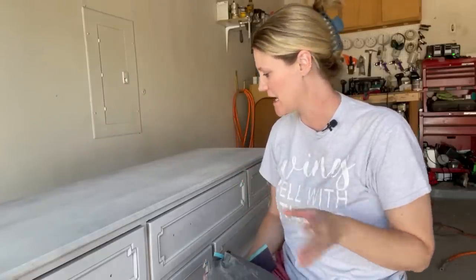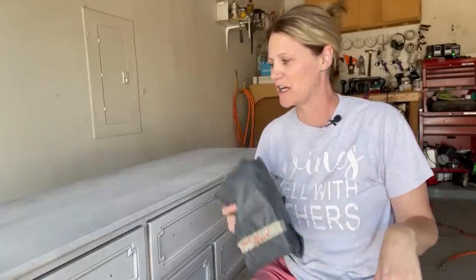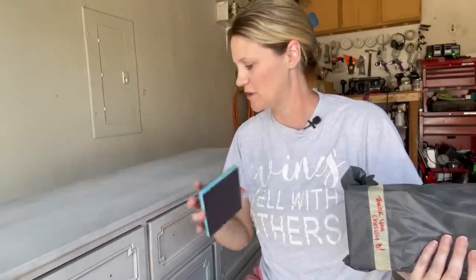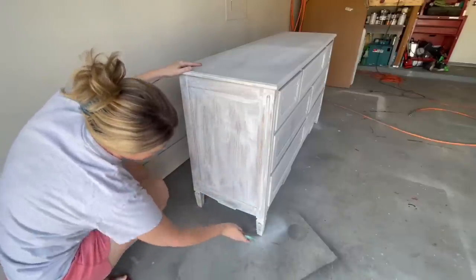My primer is dry. It is time to do a little scuff sand on the top to knock down any bits and bumps, any drips that came off the primer. I'm going to do a really high-gloss finish on this one, so everything shows underneath a high-gloss finish. I've got to be really good at sanding this down and making sure everything is super smooth before I start. I am using a medium-grit sanding pad — it is spongy and covers a wide surface, so it should go over this and get down any lumps and bumps so that my paint goes on perfectly.